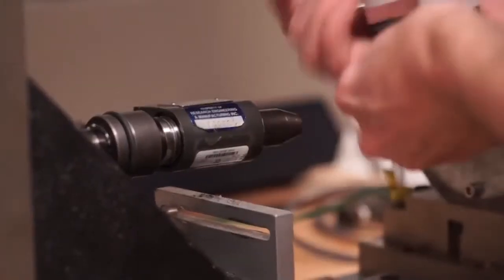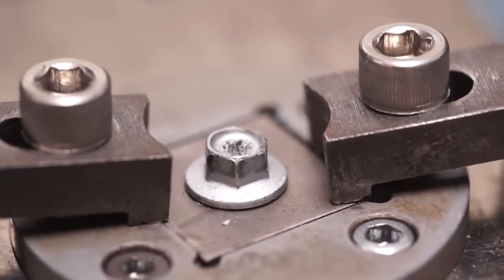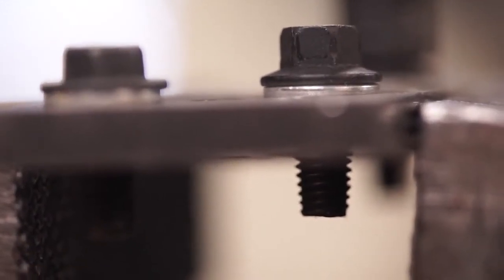They were the right people. What people were really into is the cost savings — not tapping holes, you can't cross thread. But it's evolved from there into performance because we have resistance from vibrational loosening. So we can eliminate washers, lock adhesives, and compounds. Audit checks, torques, things like that. The product has key performance benefits.